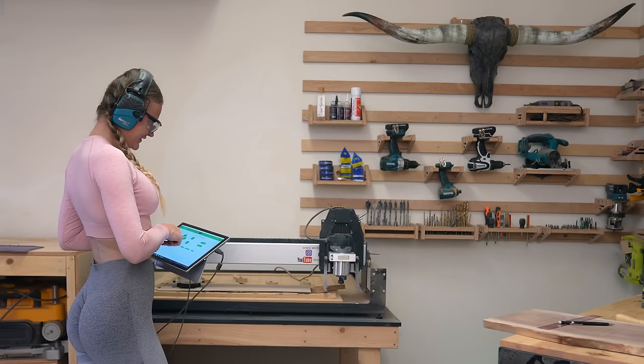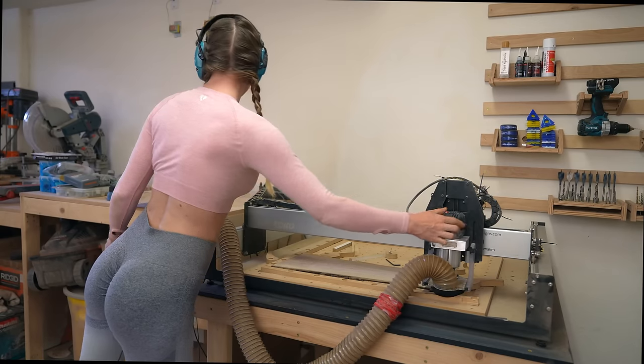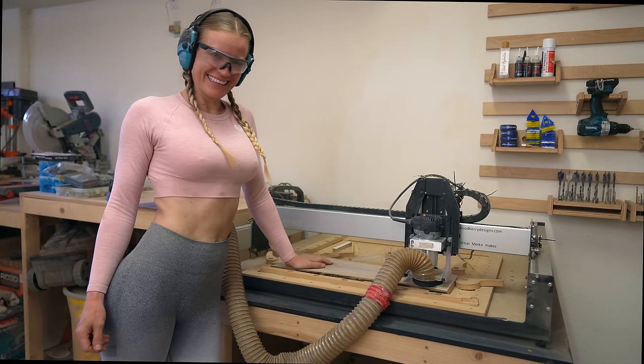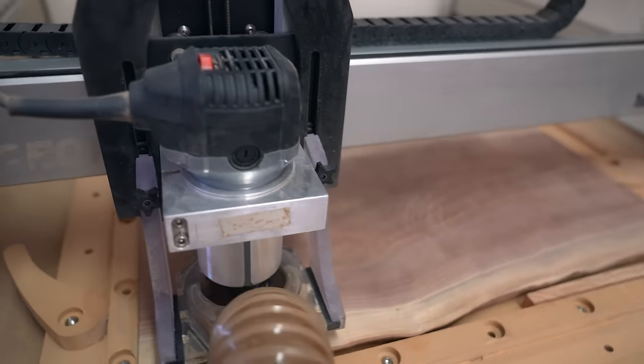I fully cut all the patterns for the charcuterie board. For the flights, I only cut the honeycomb patterns, since I want to fill them in with resin before I cut the circles. You can decide how deep you want to cut the honeycombs. If you make them deeper than the circles, you will see the continuous pattern. If you choose to make them less deep than the circles, there will be no pattern.